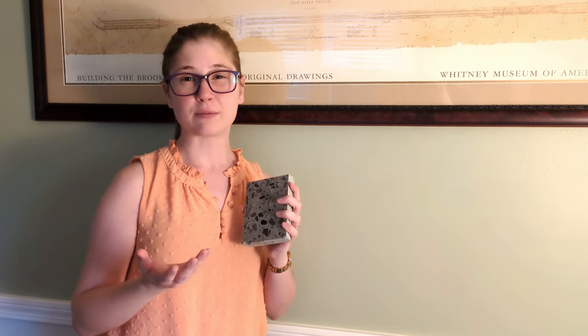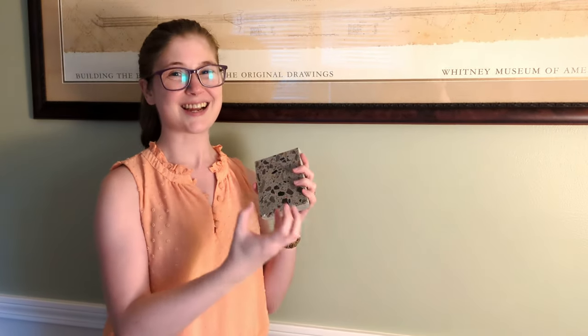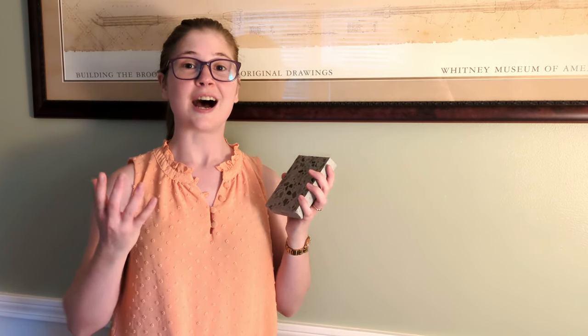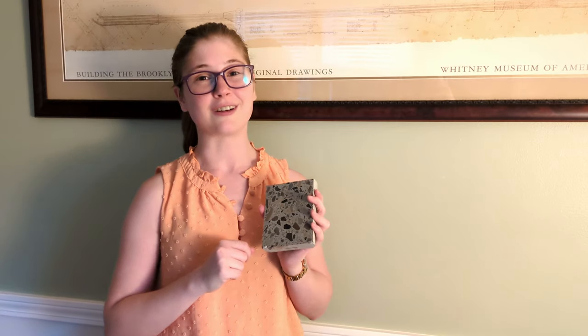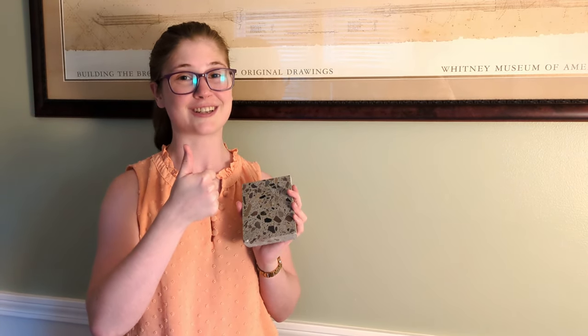The second thing I want to point out is that the base of the Pantheon has to be really thick to resist those thrust forces from the arches that make up the dome. The way they were able to do that is actually pretty interesting. Before Roman concrete as we know it, a lot of concretes set by exposure to air — so if you have a really thick structure, the inside would stay like mush. What the Romans did was realize that if they used a particular sand, a volcanic sand as the fine aggregate, they could get the concrete to set even in the middle of a really large structure, or even underwater. This is known as a hydration reaction, and we utilize the same thing in modern concrete. So Roman concrete isn't just a single recipe — they innovated between and within structures — and the reactions they relied on for strength gain aren't so different from what we use today.